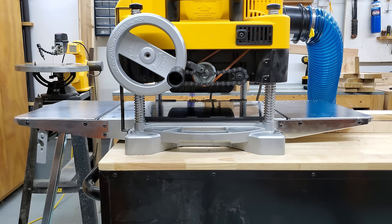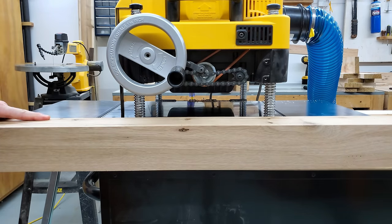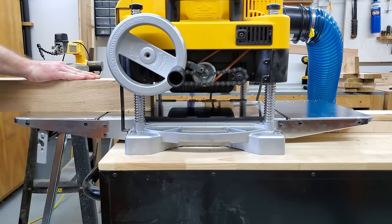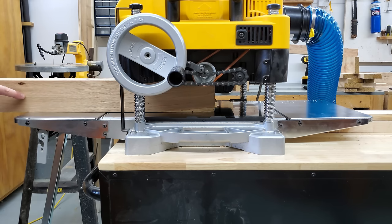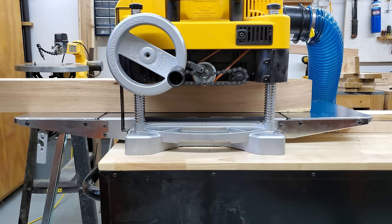That is this three-and-a-half inch thick piece of white oak. There is no flexibility in this piece of wood whatsoever — you could drive a truck over this. Right now I have my planer set so that it's not even touching this; there's nothing showing on the depth indicator. It's not even touching the roller. As I continue to go forwards, watch the gap on the bottom — the gap gets bigger because I'm riding uphill over here. Eventually I'm going to get to the other side of the planer and start to ride uphill on the outfeed table.